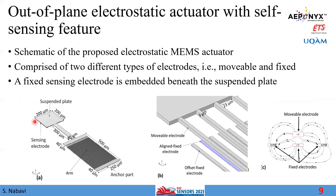This is the schematic of the proposed electrostatic MEMS actuator. The actuator is anchored from one side and has a number of fixed and unfixed fingers, as well as a suspended plate. Beneath the suspended plate, we place an electrode. Once the actuator is actuated, the capacitance changes, and by monitoring this capacitance value, we are able to identify the out-of-plane motion. The actuator works based on repulsive force, using an imbalanced electrical configuration that pushes the actuator away from the surface.